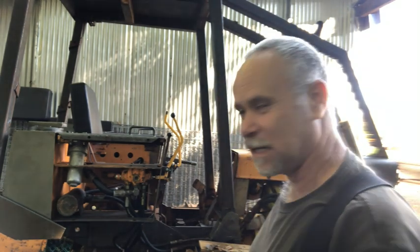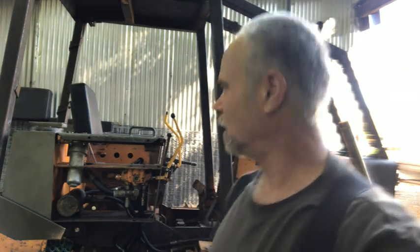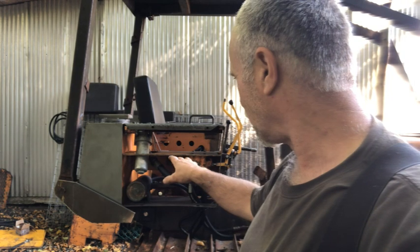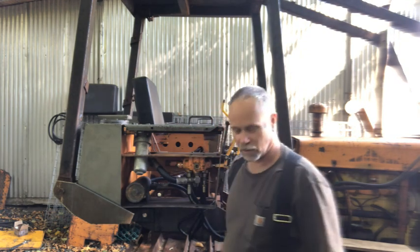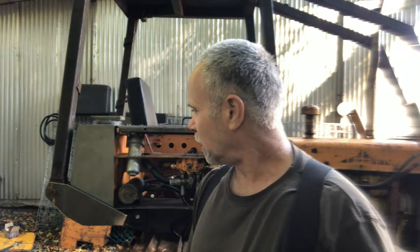If you guys have a leaky tank and an old machine like this, they're not beyond hope. This particular tank, it would have taken a lot of effort to get it out of there, because the tank is actually welded to all of this stuff in here, so it would have been quite a mess to try to deal with. But the actual tank itself was in really good shape. A few pinholes in the bottom. That Por-15 actually worked pretty good. It just sealed everything on the bottom. We'll monitor that for a couple days and see how it works out.